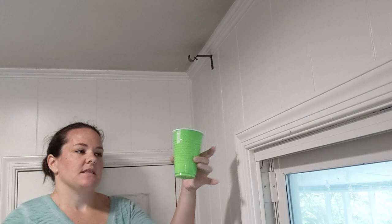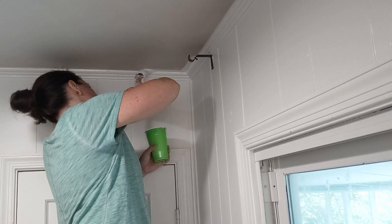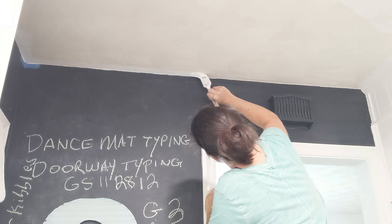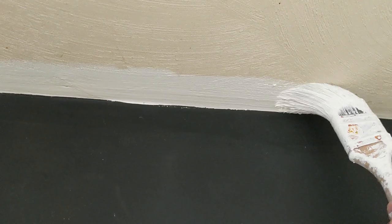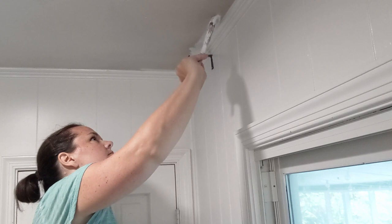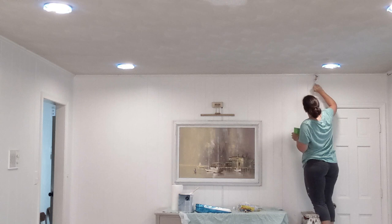I've moved my ladder here to the corner — this is where I'm starting. I put some of my paint in a plastic cup just because it makes it easier to handle as I'm going up and down the ladder. A small paint bucket is also fine, and I have my angled brush, so I'm ready to start cutting in. The room I'm painting has basically white walls and trim and also a white ceiling, so I don't have to worry terribly much about being exactly 100% precise when I'm cutting in. If you are painting your ceiling a fun color, or if you're painting your ceiling white and your walls have a color on them, you do have to be a little bit more careful. You can still skip the painter's tape if you're comfortable with cutting in, and if you're not, you can practice. It's not terribly hard — you just need practice to get your angle right.